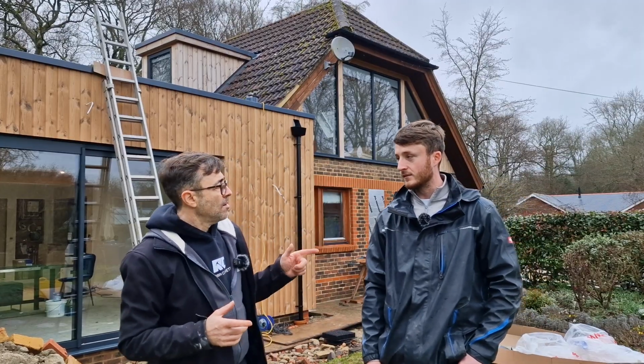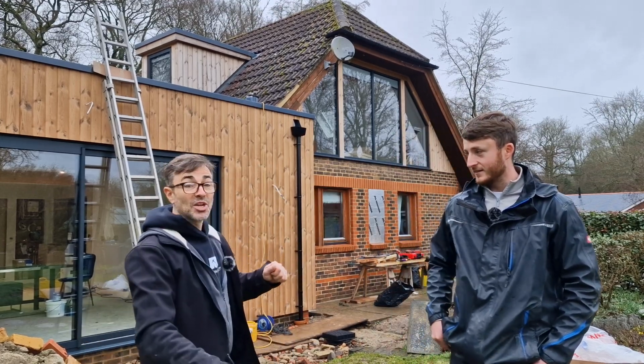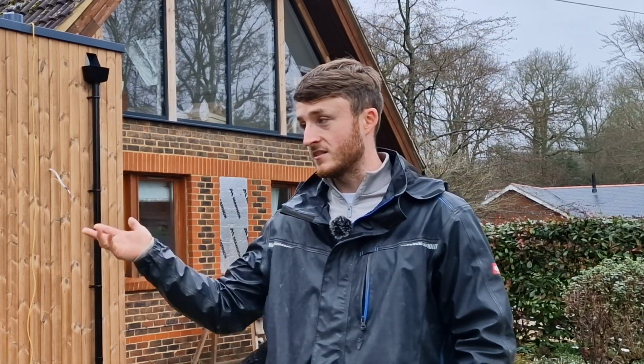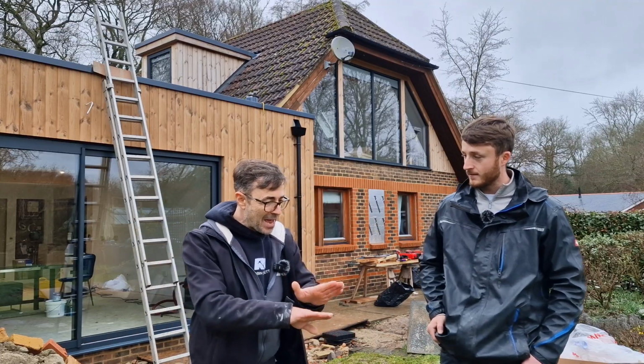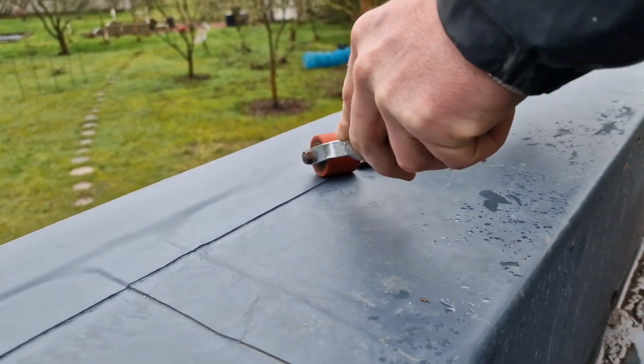I remember Simon, your dad, always used to mop down the adhesive, and on a cold day, sometimes have to put a bit of flame to it. Yeah, that one was the glue one. That was Avalon V. So this is Avalon VSK. This is the self-adhesive one. Avalon V is the one with the glue and the fire. And you roll it all out, and then you lap the seams, and then you use a special gun. Yeah, the heat gun that welds it together so it becomes one big sheet.